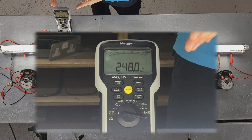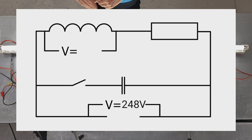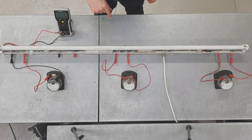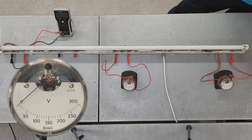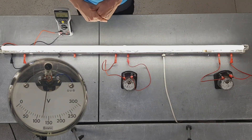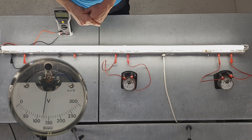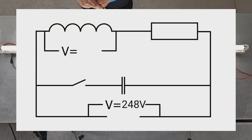So that's our input voltage - we'll draw that onto our circuit diagram. What we're going to do now is we're going to measure the voltages across the series part of the circuit, so first of all we're going to measure the voltage across the choke. When we start doing this I'm going to go back to my old analog instrument. So let's power the light fitting back up again and we'll have a look at the voltage across the choke. We can see the voltage across the choke - we're just between 120 and 130 volts there, so we're on 125 volts. I shall put that onto the circuit diagram.